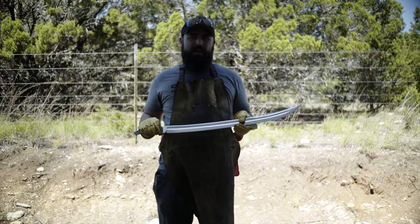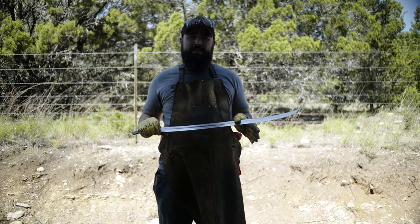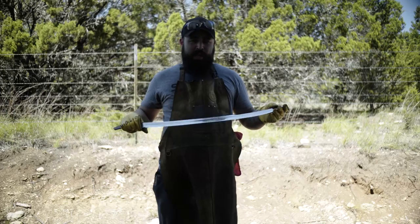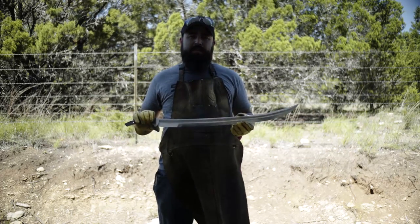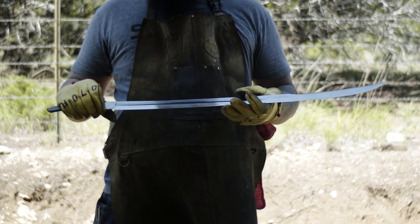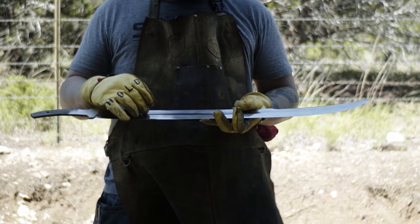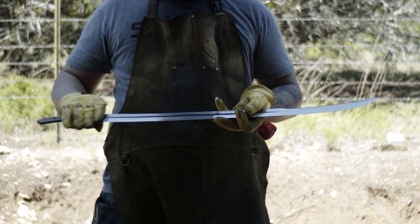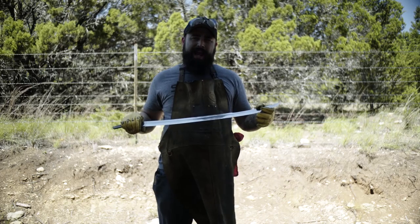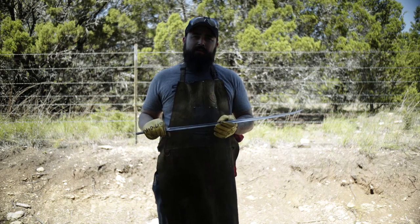The first blade I forged had a few flaws — not the quality I wanted to give the customer. So I ordered a thicker gauge of steel and went back through the whole process of beveling the edge, shaping and profiling, and cleaning it up. Now I'll enamel coat the entire blade, draw in all the artwork, then come back with the engravers and engrave out the relief areas, leaving the paint in all the negative space. When we go to acid etch, the paint acts as a resist, so the acid only eats where I engraved, creating greater contrast behind the artwork.